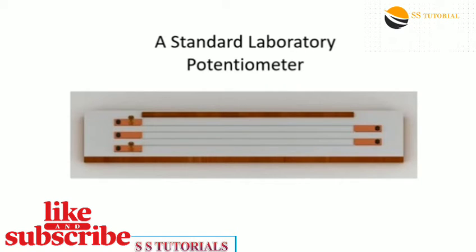First, it is generally composed of 4 to 10 wires in series, each almost 1 meter in length. Second, its principle of operation is based on potential gradient, while that of a meter bridge is that of a Wheatstone bridge. Third, though it is entirely possible for a meter bridge setup to function like a potentiometer, it will lack the sensitivity, because a meter bridge generally has only a meter long wire, while a potentiometer may have 4 to 10 times that length, making it 4 to 10 times more sensitive.